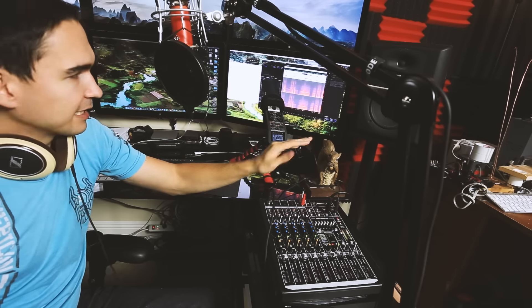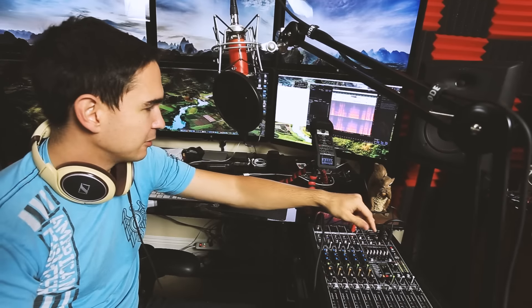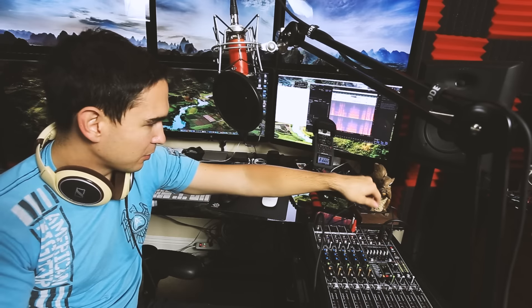I can make videos without it, but it makes my experience at my workstation much nicer. If you're doing a mix minus and you want to record, I usually use the Zoom H6 over here. I just have the main out channel quarter inch jack plugged into my Zoom H6. I won't get both left and right channels, but usually I don't care because I'm not recording stereo. If I did, I'd have to get another cable and plug that into another channel. They do have left and right quarter inch jacks to go into XLR, but I haven't found any good ones yet.